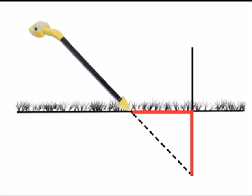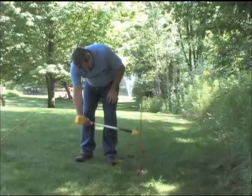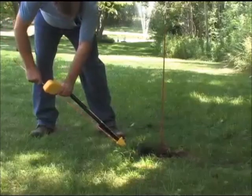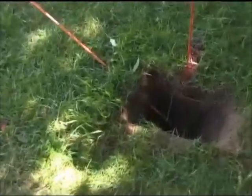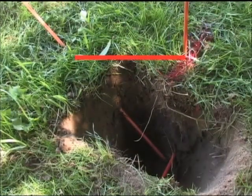The way we do that is quite simple. In practice, here's what we mean: when the wand is on a 45 degree angle and pointed directly at the underground cable, you'll get the null signal again. It is critically important that you have the wand at a 45 degree angle. The distance that the tip of the wand is from the spot where you marked the cable path is the approximate depth of the cable.